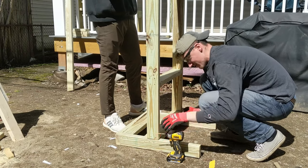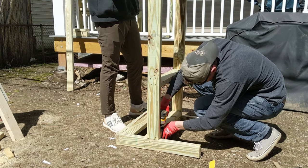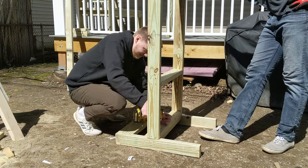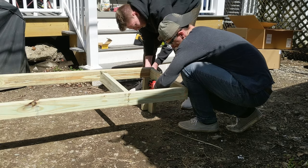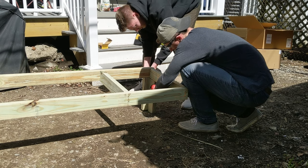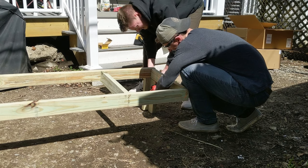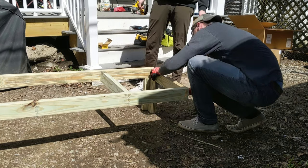After that I was able to connect the seat framing pieces to the outside arm panels. I had some help to ensure the piece was stabilized upright as the screws were driven. I then installed the front facing footings on the opposite end of the outside arm panels. I used two pieces to make this footing structurally sound and make sure it wouldn't bend or shift under the weight and movement of the couch.